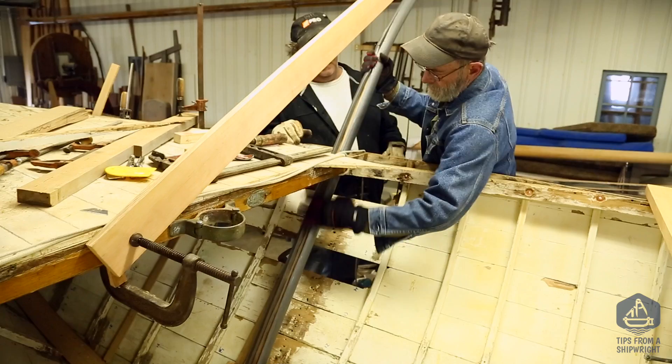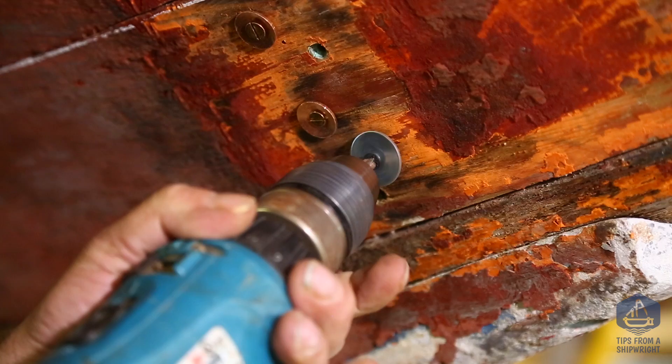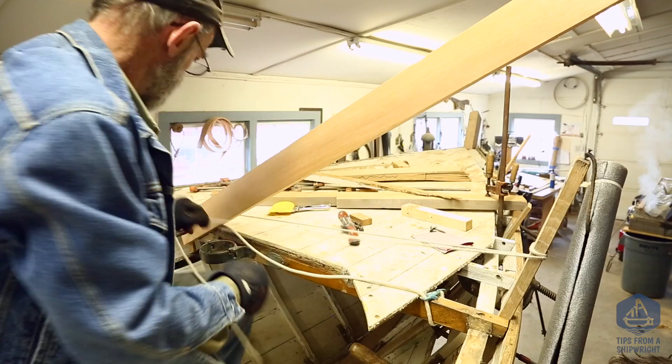Now that we've delivered the frame into position, we slide it down out of the pipe insulation as quickly as we can because it's cooling off very rapidly. It's a small piece, so we bend it into position and then fasten it in with sheetrock screws once we've drilled a hole, using fender washers because the planking is so delicate. We fasten it down rapidly, and later we'll replace those screws with bronze screws. We've tied the head of the frame over with a piece of line so that it will stay in position once it's cooled off, because the boat itself is not retaining the head too well.